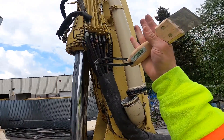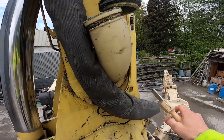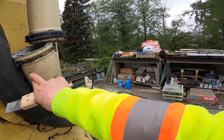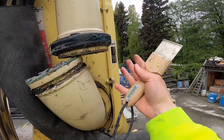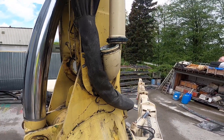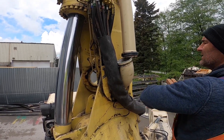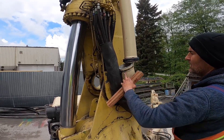What we actually did here — we should have had this boom's main section lowered more horizontal before we did this, because we have our hydraulic lines in the way. We actually can't knock this elbow down as much as we need to. So what we are going to do is take a block of wood and our hammer and just gently tap this elbow and knock it over to the other side of the pipe. Cory is going to demonstrate. It's tight — you won't get that sock over, so you have to put the wood on the other side and knock it the other way because that socket's tight.